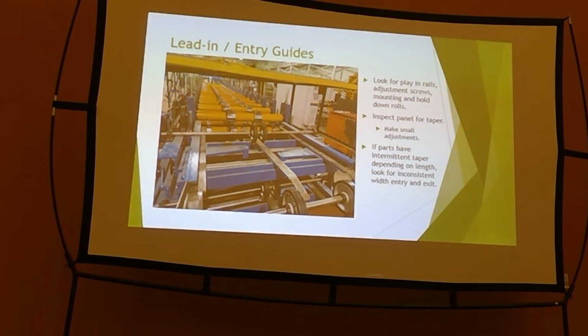So then I take a 10-foot, 12-foot panel, or blank, run it into the Rollformer and leave 5 foot of it hanging out in front of the lead-in. Then I run through the shear with new material off the coil and overlap those 2 pieces of material laying out on a conveyor. If the edges are in line, you are in line. You're gonna see that when that thing runs out and they're sitting there at a crisscrossed angle, you need to either move your entry equipment or move your Rollformer to where you're not pulling tension through your conveyor from the shear to the roll former.